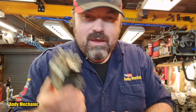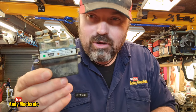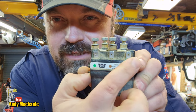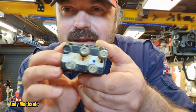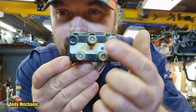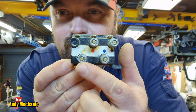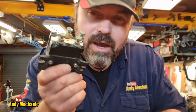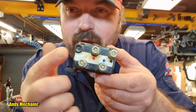This is a WARN — they call it a contactor set, but it's actually just a solenoid pack. If you're English, we'd call this a solenoid pack. We've got the trigger circuit terminals here — these are the low current flow terminals, each labeled with a particular color. Then we've got the load side of the solenoid with four terminals in four respective colors: black, blue, red, and yellow. Without a wiring diagram, you can tell these are the larger terminals on the load side.